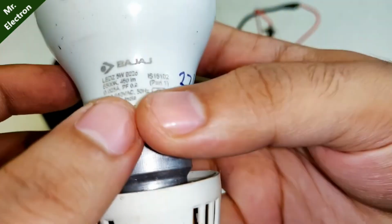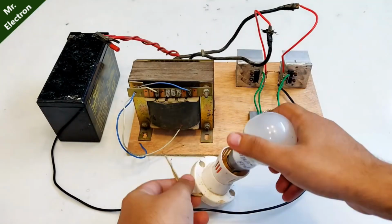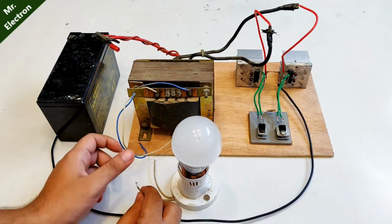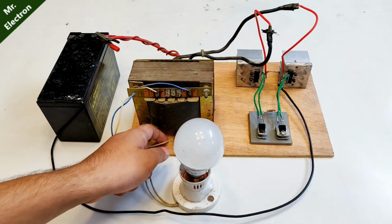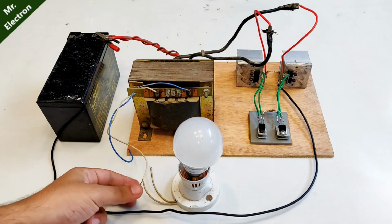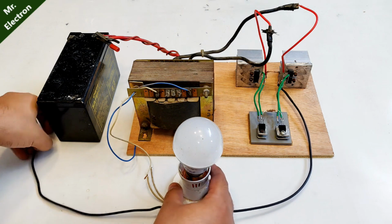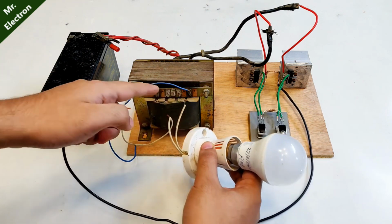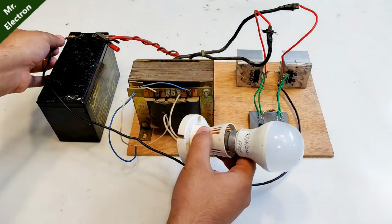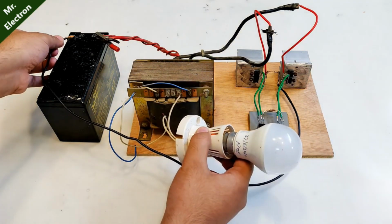So guys, starting with this 5 watts LED bulb, Bajaj LED bulb. And guys, I forgot, if you want to watch the making part of this circuit, you can watch it from the link provided in the description. It is really important for the making part of this inverter. Okay, one wire, the white wire has been connected. The blue is empty, as I said, not needed. And let's start it and see how the bulb glows. I will have to touch it to this terminal, this one, because it produces 180 volts AC. Okay, you see, no flickering at all, glowing perfectly.